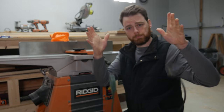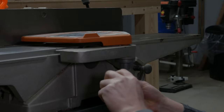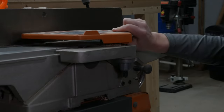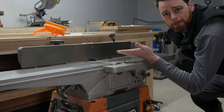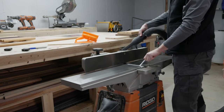Step 1 is to unplug and check that your power is off. Next, take the blade guard off by unscrewing the screw at the bottom and lifting the guard up. Then slide the fence back all the way so you have full access to the blades. At this point, I like to vacuum all three sections of the cutter head, as it makes work easier if there are any wood chips in the way.